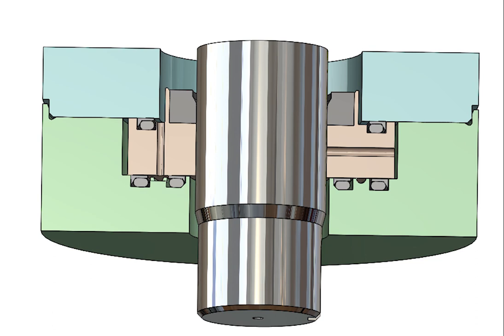The pressure of the lubricant acts over the sealed area created by the rotary seal and the face seal. This produces a hydraulic force acting downward on the backup ring. An axial hole conducts the pressure of the lubricant to the sealed region between the inner and outer balancing seals.